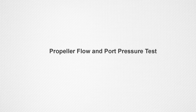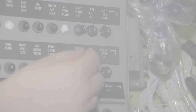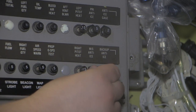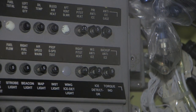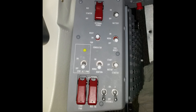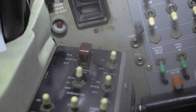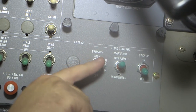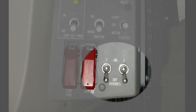Remove external electrical power from the airplane. Disengage the circuit breakers on the left-hand circuit breaker panel that follow: primary anti-ice, windshield anti-ice, backup anti-ice. Ensure that the following switches are in the off position: external power bus switch, battery DC power switch, fluid control primary, fluid control backup, avionics bus 1, avionics bus 2.